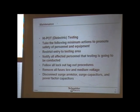You're probably going to have permissives in here as well that are going to be required first, and then they're going to be more or less like little contacts in between here and everything else. For whatever reason, it could be an interlock switch, a little micro switch, that allows the voltage to make the contactor close. So once again, these are all switches compared to a breaker.